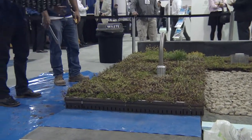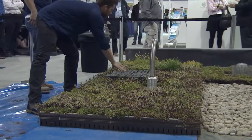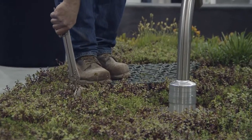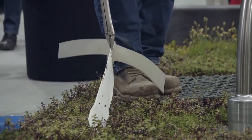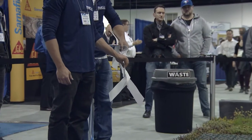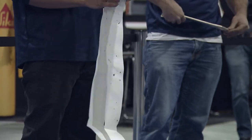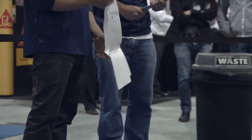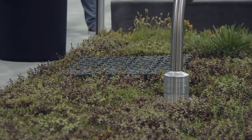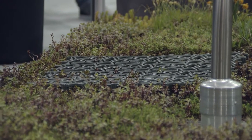A way to deal with temporary traffic is called a grass paver — actually used for lawns that double as driveways. You can use these on the green roof to allow temporary traffic without detrimental effects. This particular green roof system is also equipped with soil elevators: they're used during production and installation, then removed during installation, allowing everything to grow together. Even with modular green roofs, it's important that everything is allowed to grow together — so it shares nutrients and resources across the plants, and improves wind uplift resistance.